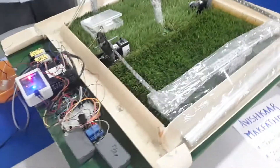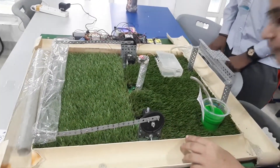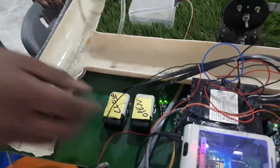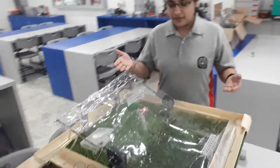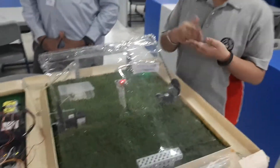At the time of harvest, further irrigation of the crop is not required. So if it starts to rain, for that we have installed a dome — a kind of shed which operates on motors. We have attached two motors here. When rain arrives and the farmer sees that his crop might get damaged, he may use manual control to cover the field. By the single push of a button, the fields can be covered, and the water that falls on it will be directed through pipes and channelized to an underground tank which harvests the rainwater. This rainwater can be further utilized by the sprinklers in case of a fire or for irrigation.